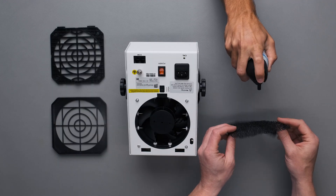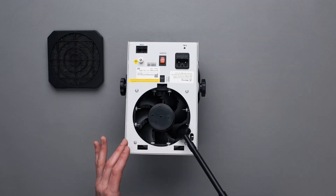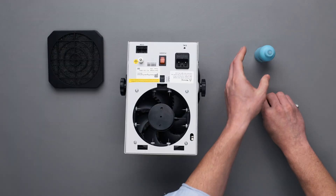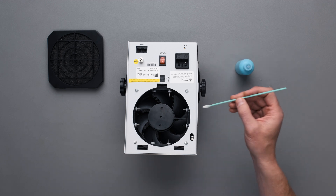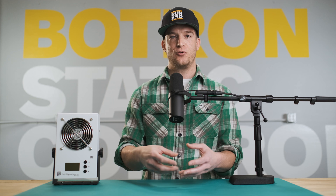You're always going to want to use the right tools and cleaning agents to prolong the life of your ionizer. You could use canned air or an air gun to blow off grills and fans, but it might be better to vacuum them using an ESD-safe vacuum attachment. As for filters, you can bang them out in a trash can or use compressed air, which works really well. Some filters are washable, but this will increase your downtime. For the emitter pins, use non-corrosive, non-residue cleaning agents. This will differ depending on the metal composition of the emitter pin, as some metals react with air and create a natural layer of corrosion resistance. Cleaners that leave behind a residue will create pitting and impact the ionizer's ability to charge the air. IPA is usually a safe choice, but do some research on the metal type used in your ionizer.